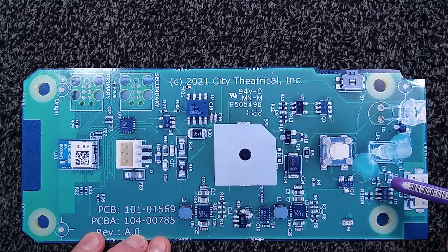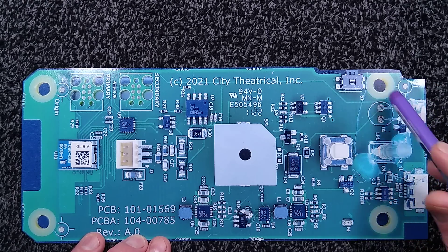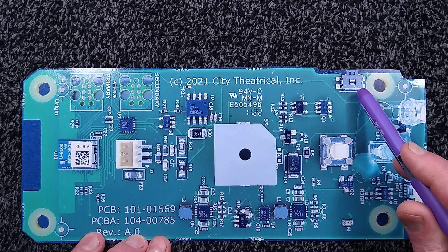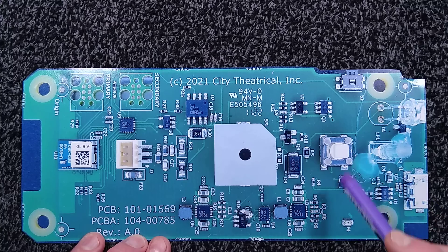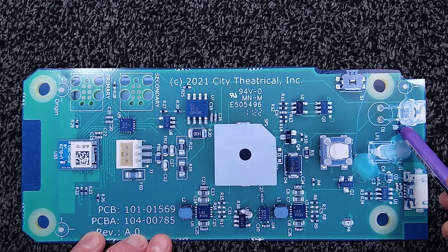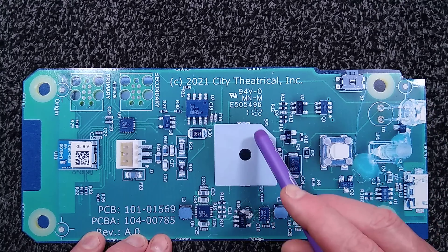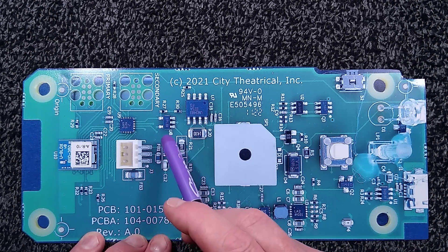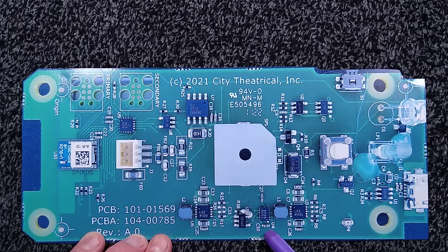There's a button on the side for the LED used as a momentary-action flashlight button, though it's likely read in software so it could be a multi-function button enabling dual-press for particular functions. Here's the main button for turning it on and off, and held in place with hot-melt glue is a little light guide over the LED. I can see transistors — possibly one for each LED and one for the sounder. This area of circuitry looks like a couple of voltage regulators, and notably there's what appears to be a modification added afterwards — a capacitor placed across it. There are also components marked XB1; looking up XB1 in SOT-23 didn't find much — could be protection or regulators.